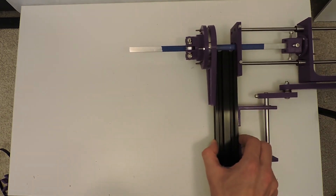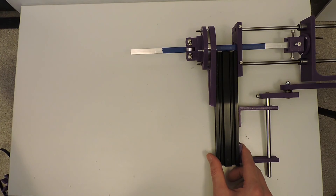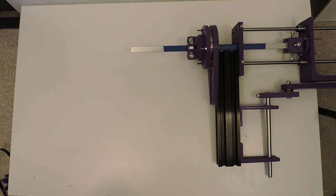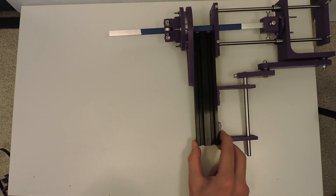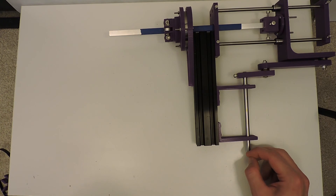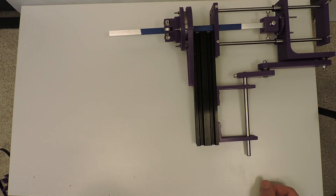I will have two of these opposing each other — one on this side, the blade goes here, and then another one that moves in sync with it. So that's about 300 grams moving total — still three times lighter. But since we'll be going faster, we still need to dampen the vibration, probably by moving the same amount of mass in the opposite direction, over on this end of the actuator so that the moments balance out and the whole thing doesn't torque back and forth.